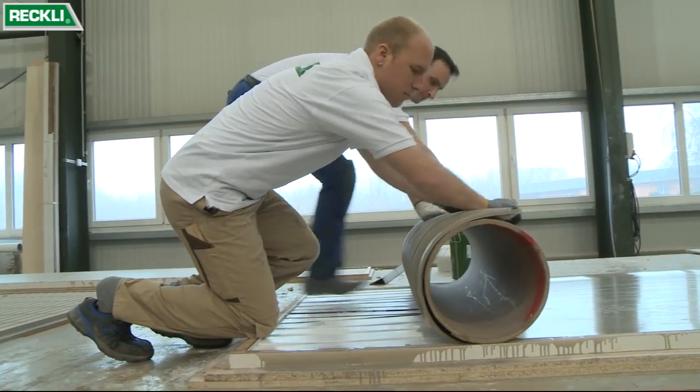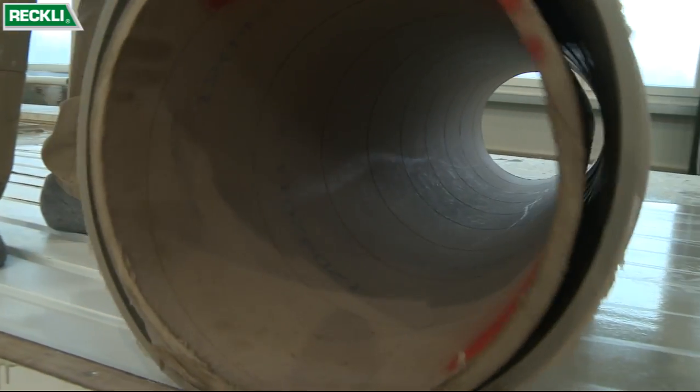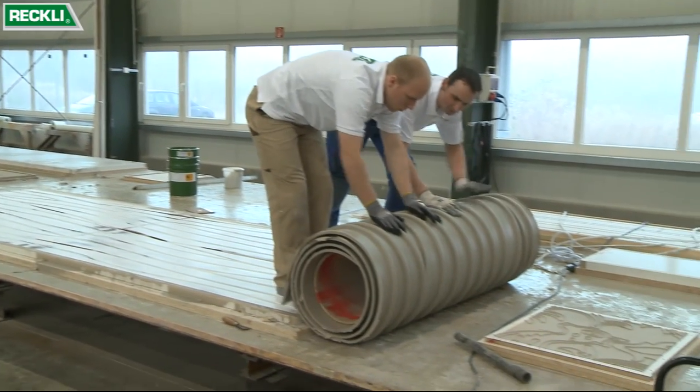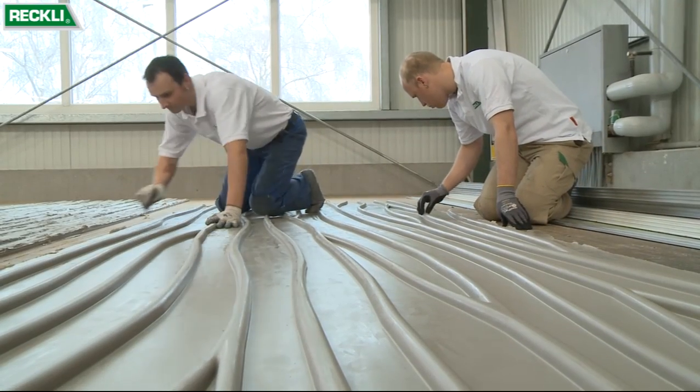At this size, the mold is removed by rolling it up onto a cardboard tube, which is then also used for transportation. The form liner is laid out on an even surface until it has fully hardened and is checked to ensure that it is not blemished in any way.